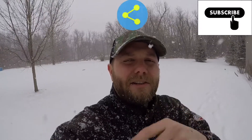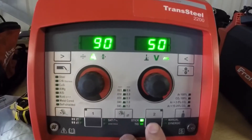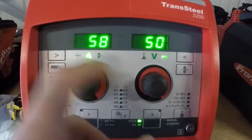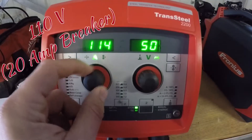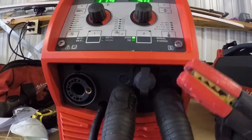If you like my videos, please hit that subscribe button, share with friends, or follow me. Let's see what it does — go ahead and set it to stick mode. I'm on a 15-amp breaker so I get 90 amps, and on a 20-amp breaker I get 114 amps. Make sure your ground cable is on minus and your stinger is on positive.